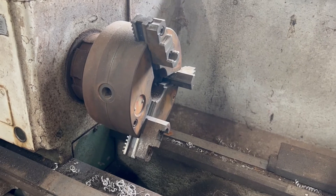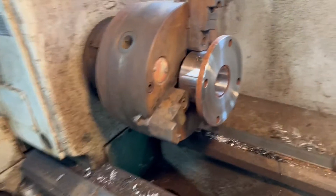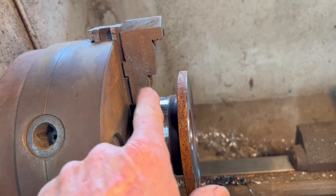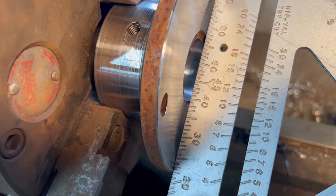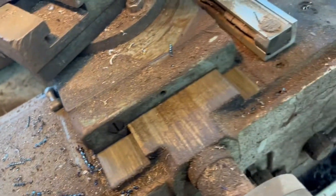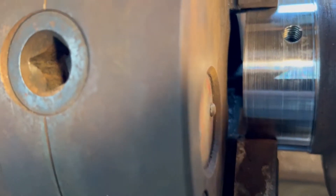I haven't used a lathe since my LSU days so I'm a little apprehensive. I've been messing with this lathe for a while — it's pretty awkward because I don't know any of the controls or where the wrenches are, but I'm gradually getting it. First I had the flange turning the wrong way. I put this piece in the jaws to use as a new reference point, honed out the inside, then started facing this surface — but I got a dish and I don't know how I did that, since I was just using the cross slide.